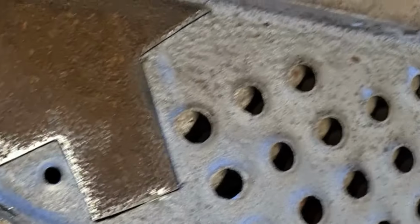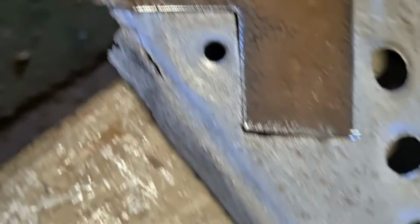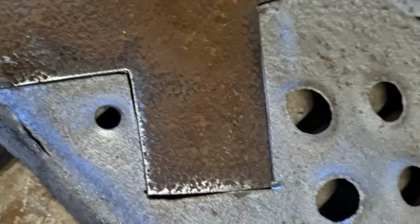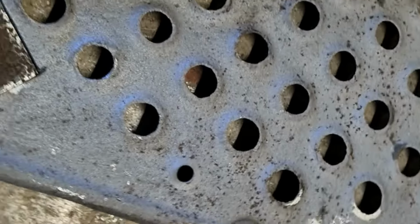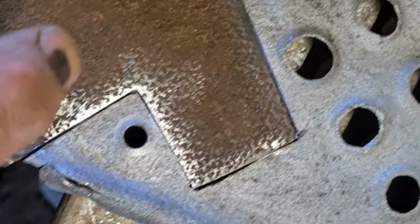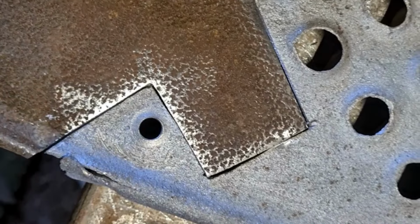Right, so we've just fabricated a piece of tin there, look. Just put the bend in. Just got to make a little piece to bridge that gap out a bit, and then when my underbar fits in here, there's two holes here, and one sits in here and one will sit in there. That's why I left that hole purposely, so I could pick it up and get it in the right place. So all that remains then is just to weld that up.